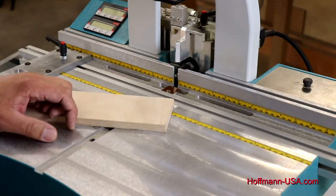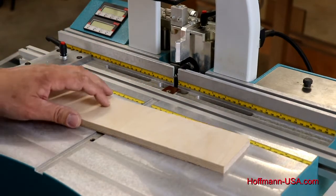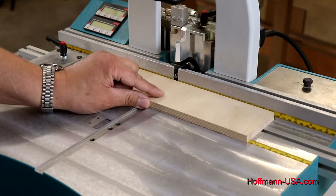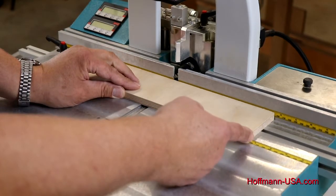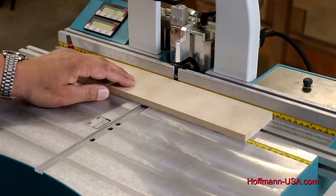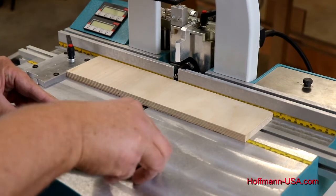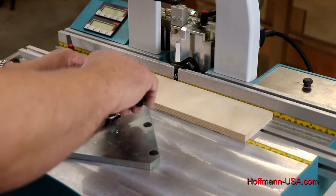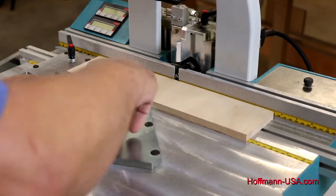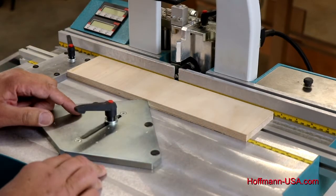I have a piece of plywood here — any type of flat straight molding will work. Place that on top. The router bit, because of the rotation, will tend to move your material to the left, so using a square stub here blocks that sideways movement, which is helpful. Then I also like to put my normal fence plate on here, tighten that up, and push it in so now my scrap piece is tight back and forth and left to right.